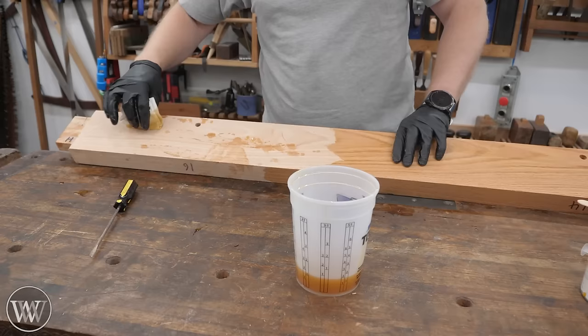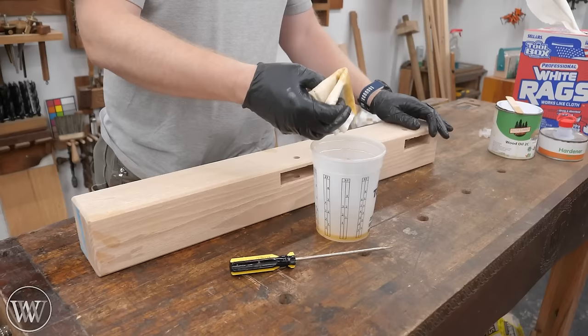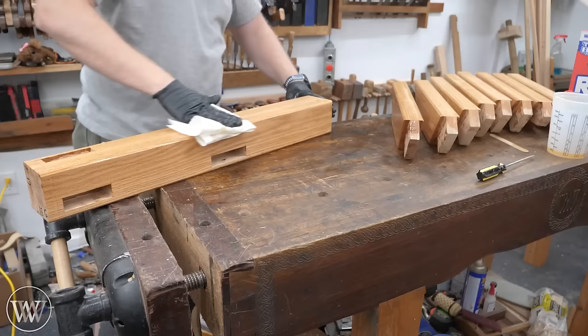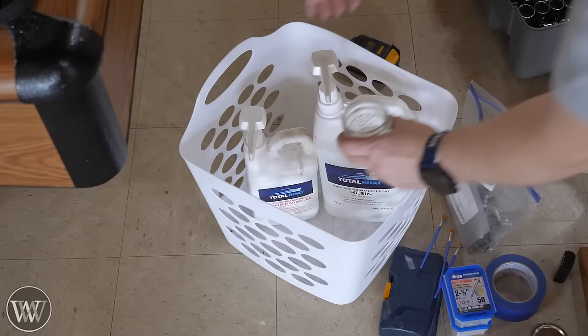And that's it — it's done. If I wanted to come back in, I could use a ceramic coat on top of it and add a little bit more protection. I may end up doing that on this one at a later date. I don't actually have any in stock at the moment, so I may end up going back to camp in a few weeks and putting on the ceramic coating. I want to see how it goes without that. I've actually really been enjoying this finish — I love using a simple hard wax finish. Set it on, polish it off, one coat and done. This one is nice because you can actually build up coats. With Rubio Monocoat you can't build it up, but with this one I can.